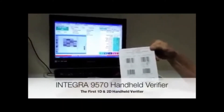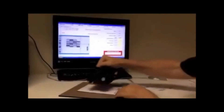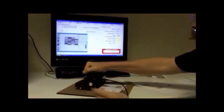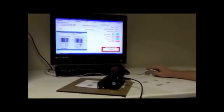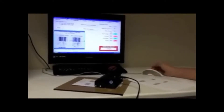Each system comes with an EAN UPC Calibration Conformance test card. Go to the calibration screen and place the calibration card onto a flat surface. Position the scanner at the top of the calibration card and scan down through the card about 3 inches. The image will appear with an EAN symbol on the left side and a UPC symbol on the right side.